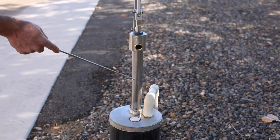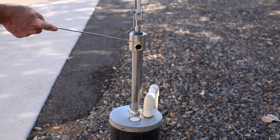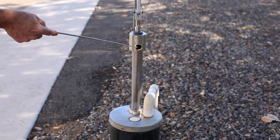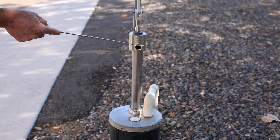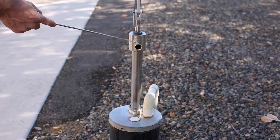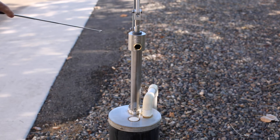What we're showing you now is a frontal view of the simple pump model 125L hand pump. This is the discharge fitting that allows one to connect directly to a drinking water hose or garden hose. Or this fitting can be relocated to the far end of a check valve and gauge that can get mounted here, and then the pump used to make a connection to a yard hydrant or a spigot on the outside wall of your home for charging your pressure tank.